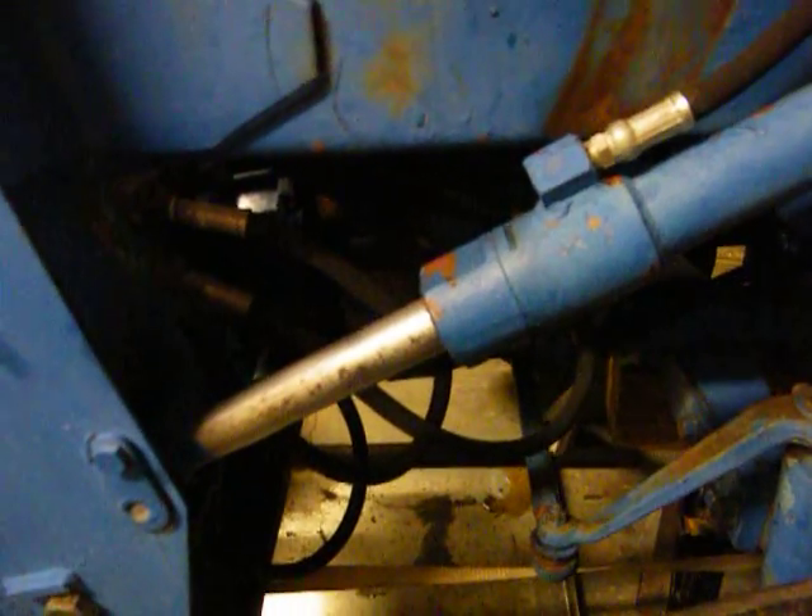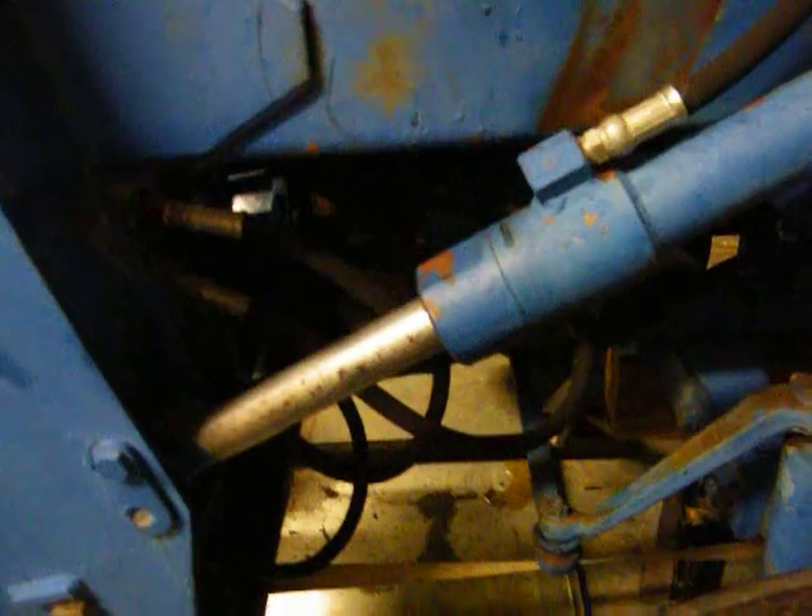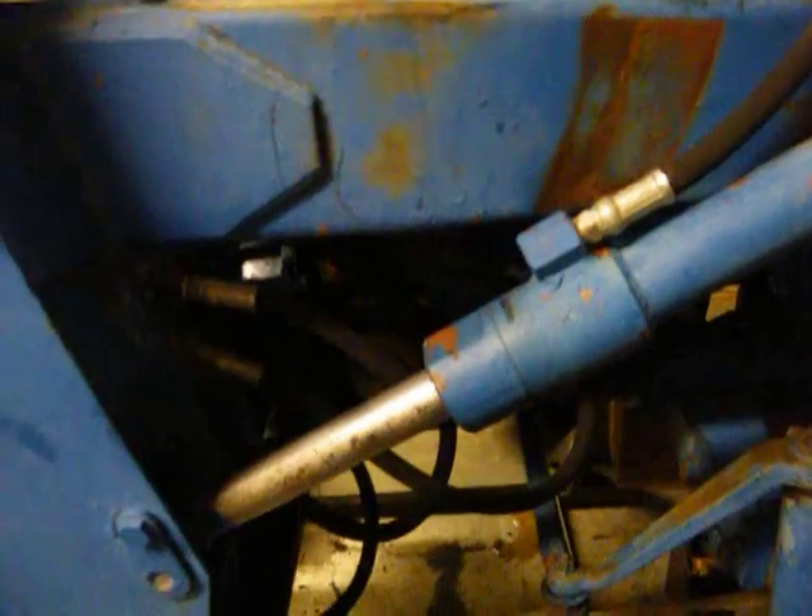It's not a major leak — I'm hoping it's just the puke tube, the vent case tube. I pressure washed it before I brought it in. I'll crank it and run it tomorrow, and after that I'll run it for about 30 minutes. I've already run it for a solid hour running the PTO and working the hydraulics. I put Seafoam in it.